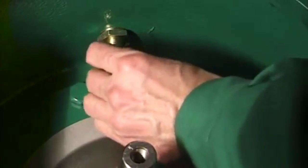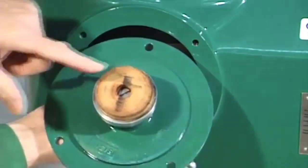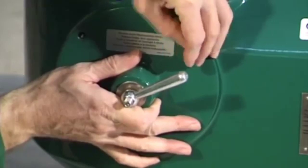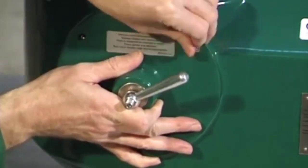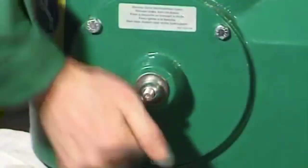Fit the operating water connection in the upper section of the frame. Screw in the joint with the pipe. Fit the brake and brake housing to the lower section of the frame with 3 metric 8x20 hex head screws. Attention! Check that the brake has been released.